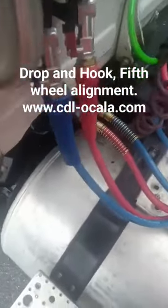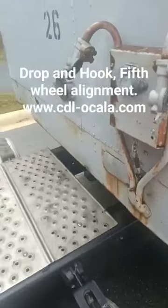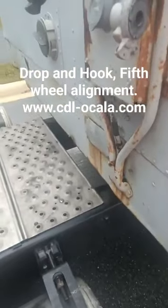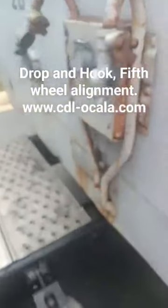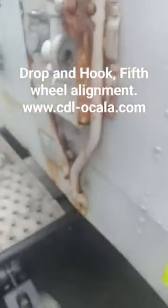And you'll see some trucks with a broken window, or the sleeper's all caved in. Why? Because the driver forgot to undo the lines, and when those things go, it's like a slingshot. It's going to go through the window, damage the back of the sleeper, or jump up and hit these flares. There's enough tension in there that I've had these glad hands actually break when you're not paying attention.